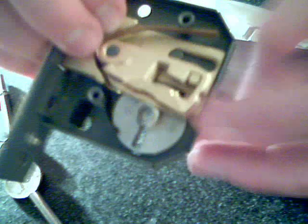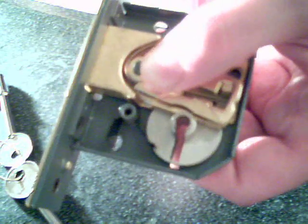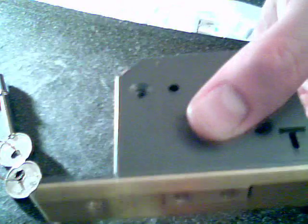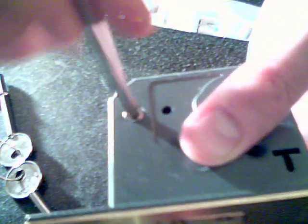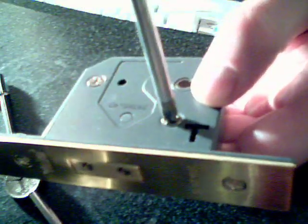There are five levers in there. These here are the springs for the levers, to keep the levers pressed at the bottom. There's another spring here which just provides tension to hold the lock in place when it's locked. It's a fairly simple mechanism. Now this here is just a cover plate - that unscrews and you can put the screws in the door behind it. Just get the casing back on like that, and then pop the screws in. It's extremely easy to take apart, even though the levers do tend to be a bit frisky.